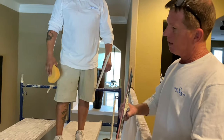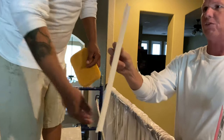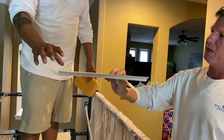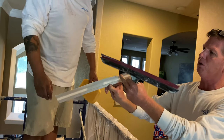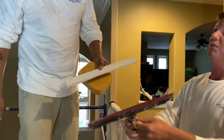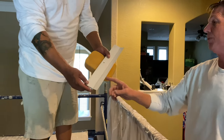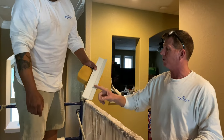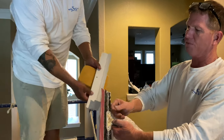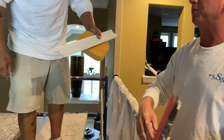The rubber on it is kind of difficult to get inside the creases. So Eli got this, which is actually a threshold from a garage door. He was just in Home Depot playing with it, and he got it. This rubber is really, really loose, so it's more forgiving when you knock down, as opposed to this one, which is really thick. If you're not super steady, this can work, but this is foolproof. If you have a lot to do, you can get a piece of this. It's an 8 foot piece you can buy and cut. You can take the handle off of a Magic Knife and screw it onto this, if you're gonna do a ceiling or something.